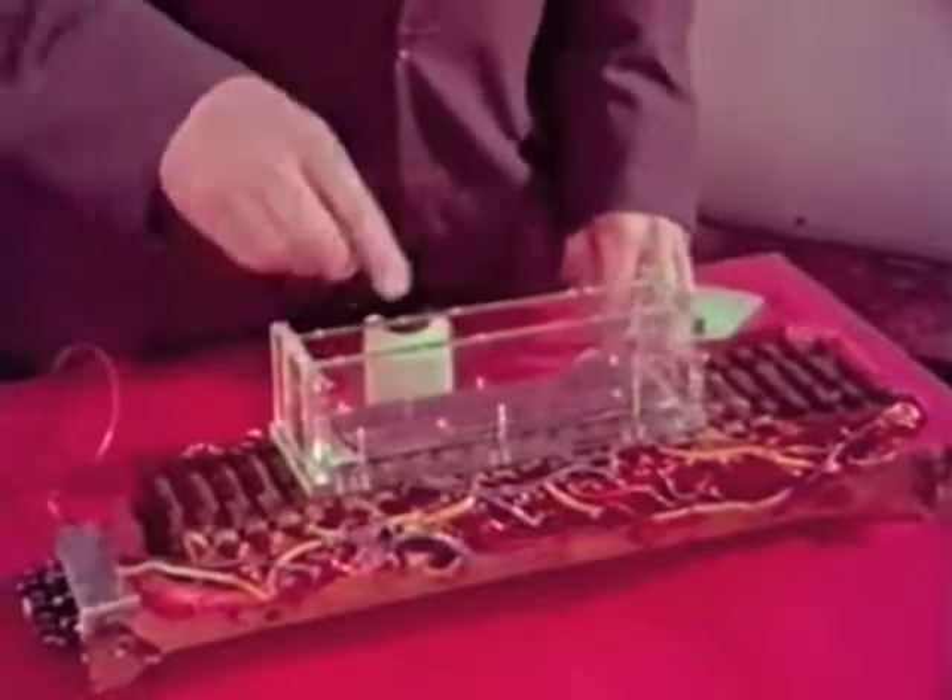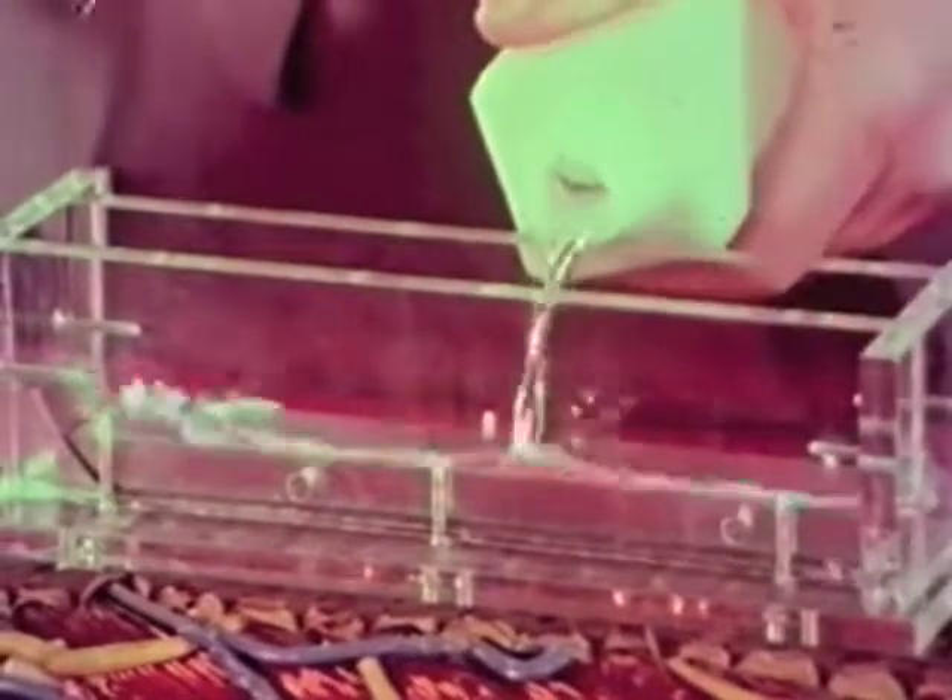I'm afraid I can't show you MHD, as it's shortened to, very simply, but I can demonstrate that we can pump fluids by pumping mercury rather than a gas. This trough has a piece of steel fixed into it to improve the magnetic circuit of this motor. When I pour mercury into the trough it's going to flow underneath the piece of steel and be pumped along the bottom, up this end, and flow back over the top. When I switch on the magnetic field you can see the mercury making a small fountain at this end. It isn't easy to see mercury flowing, but you can float a coin on the river, and I hope this convinces you that we can pump fluids electromagnetically.